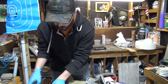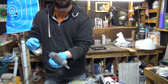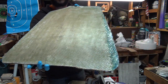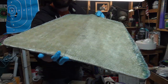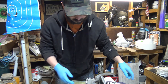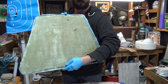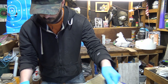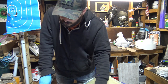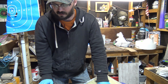I went ahead and trimmed these up using a grinding disc, cutting disc, and a Dremel to do most of the work. We trimmed off all the excess and got them into shape — there are a few impurities on the surface that need to be sanded and buffed down. For any loose fibers without a lot of resin, I just took the shears and cut them off. Here's how both of them ended up looking once trimmed. For the rifle rated one we're looking at 6 pounds 15 ounces, and for the pistol rated one 6 pounds 11 ounces — that's without the polycarbonate.